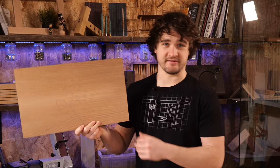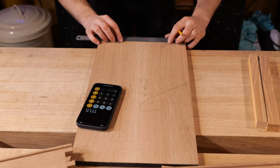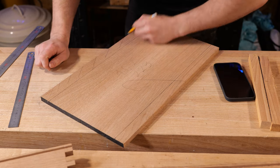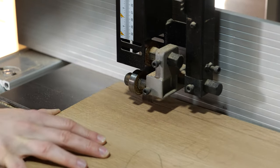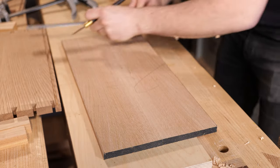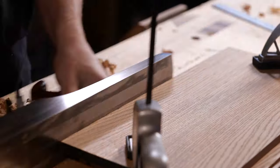We've been through the sizing process before, so we'll gloss over it. But instead of just going for it as-is, I'm going to slightly reorient things so that I get that nice white stripe directly through the center of the piece. So 223 divided by two equals 111.5. I'll put the ruler on 111.5, mark at zero, mark at 223, and do the same on the other side, then join those marks. Mark the waste, slice those off on the bandsaw getting about a millimeter away from the line, then carefully plane one edge straight and square. Measure up, put a knife mark at 223 on both ends, connect those marks, and plane back to that line.